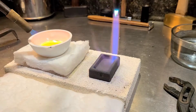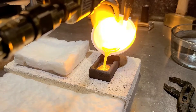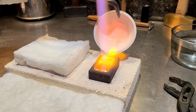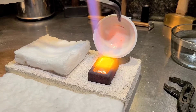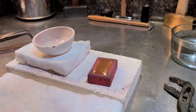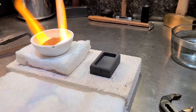That mold is definitely up to temperature — it happens quick, but I do shoot it with the laser every once in a while and check the temp. Here we go, another pour. It was uneven and the cooling pool is kind of sloshy, so I'm keeping the torch closer to buy more time to get control over it. I'm losing it, it's overheated — that wasn't it. We got a red hot mold. Yeah, a little overkill; I tried to save it and it just wasn't happening.